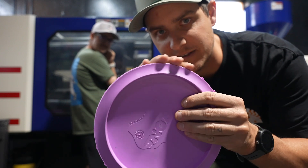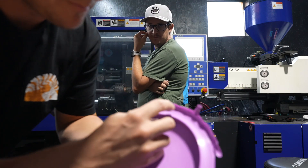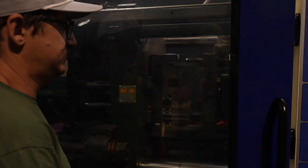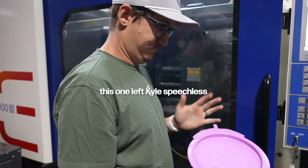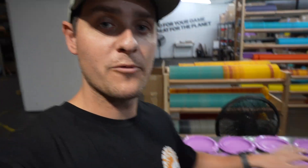This is not what we expected. We were expecting way more flashing around the edge. Here's 1350 — you can see flashing all over the place. At 1500 psi, there's more flash still looking pretty good. The pressure is now 1750. One of the issues is the disc comes off the machine and it looks good, but we still have to let it cool for a full table to see what ends up happening.